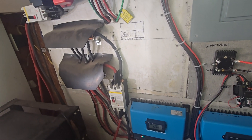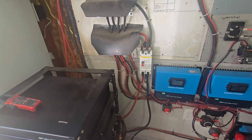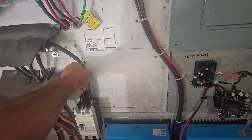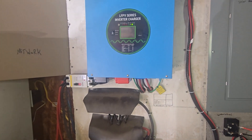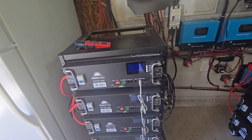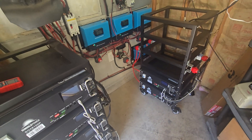Now when we charge this side, we have 32 550-watt panels up on the roof. At 3 or 2 o'clock in the afternoon you can touch these wires and they're a little warm but not bad — that's when they're pushing 250 to 300 amps. It's all Sun Gold and I love Sun Gold; I have no problem with it whatsoever as long as you know how to install it. Thanks for watching, have a great day.